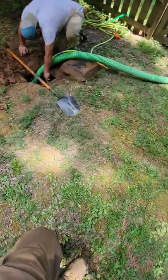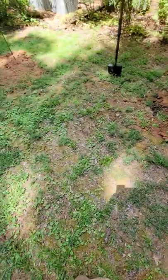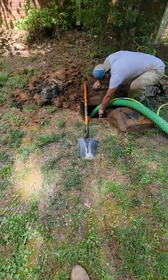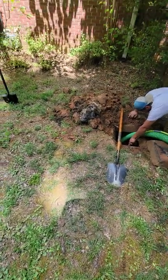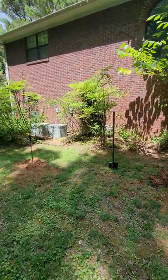And if you want to know about this tank — it's way over here. We missed it by a few inches, literally. We probed right there, tank's right there. Sometimes pretty disappointing, guys. But in summary, for a residential 1,000-gallon concrete tank: look for the dead spots, look for the clean outs, look for the vent pipes on top of the house. We really appreciate all the likes — if you would, hit subscribe on our YouTube videos. Until next time, Greenpro.